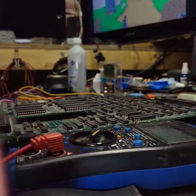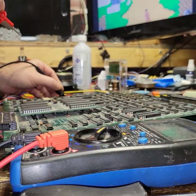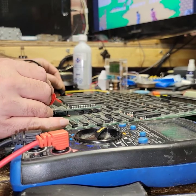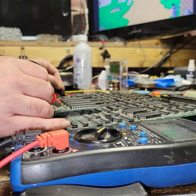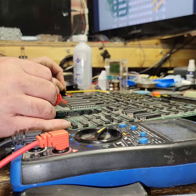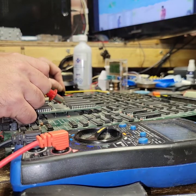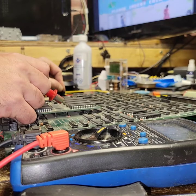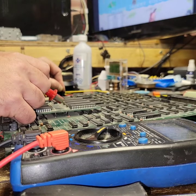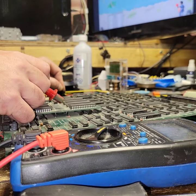Now what are we getting for voltage? First of all, what are we getting at the harness? Wow, that's all over the place. I thought that would be a lot more stable. It is more stable — it's at a good 4.5 and that's it. But four and a half volts is probably not enough. Oh, but it's not resetting, so it's probably right on the cusp.